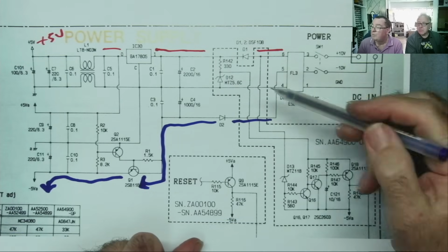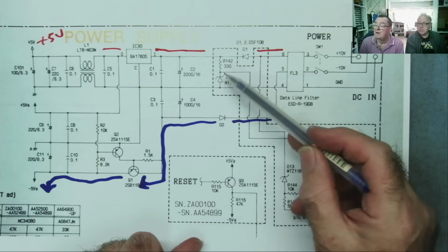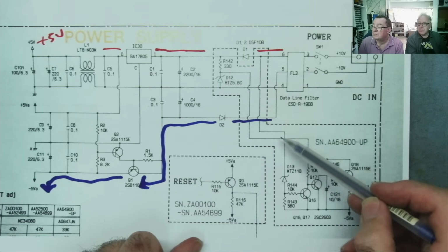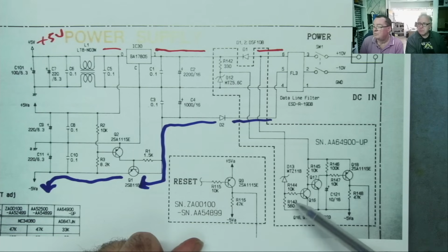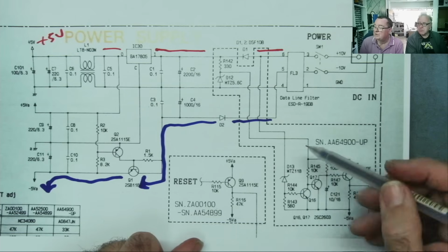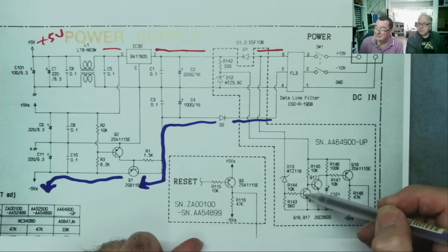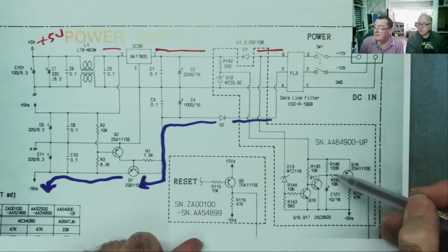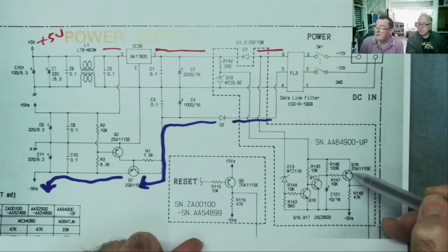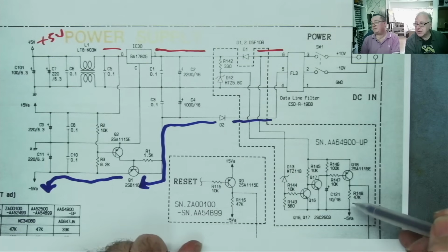I don't exactly know where, but what we have here, from the plus 10 to ground, is a Zener diode, 5.6, which puts the voltage onto here. Another Zener diode, which looks like an 11 volt, just guessing that one. And the way I see this is that if this Zener is conducting, so there's enough voltage here, it'll turn this transistor on, the collector will come down, turn this one off, so the collector goes up. Oh, this is PNP, so actually that goes up, this will turn off. And the voltage here, and this thing is connected to minus 5.